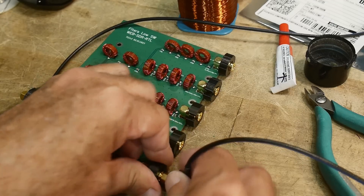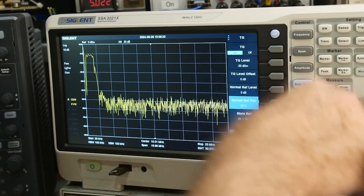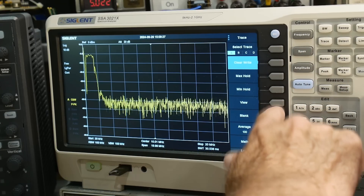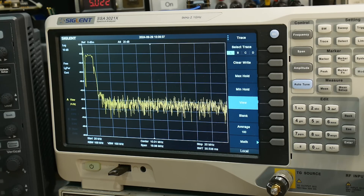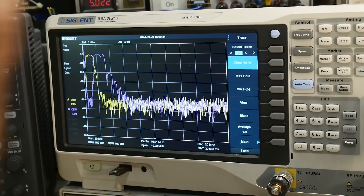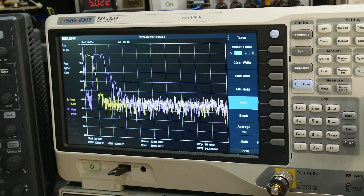Into the lowest frequency and we get a bandpass filter — there's this nice hump here. We'll store that as Trace A. Sorry about the dryer. We'll move on to the next filter. We'll store that as Trace B — there's our next filter. You can see that one and that one. That one's really nice. It's just taking bandpasses out of the whole frequency spectrum.